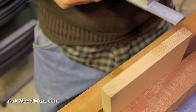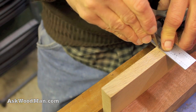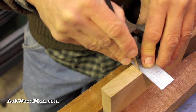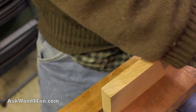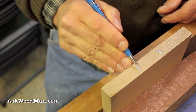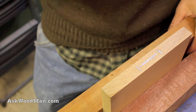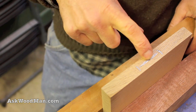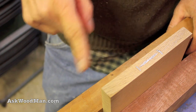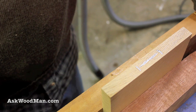I'm going to cut one more mortise to show some versatility. This is a piece of white oak, about three quarters of an inch. I'll put my scribe mark on here - you don't scribe all the way to the edge because you can see that on the front of your joint. I'm going to do this mortise with a straight bit so you can see you can also use your plunge router with a straight bit. The spiral fluted ones work a little better because they act more like a drill going down at high speed, almost like an end mill that metal workers use, but a straight bit can work too.